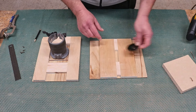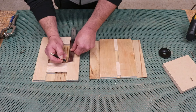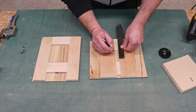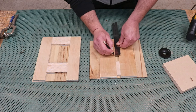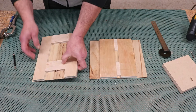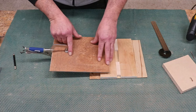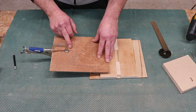So all I need to do is just mark those up — I'm going to mark this one at 110mm and this one at 36mm. Then I'm just going to put that in position, clamp it in place, turn it over and put two screws in the back so that I can adjust it at a later stage if I want, just by removing those two screws.